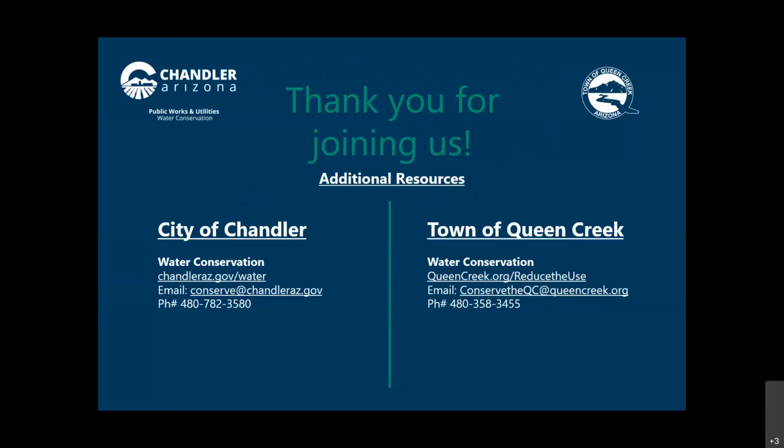Okay. The first one is, any recommendations on moving emitters when the canopy is over the sidewalk and driveway? At that point, you are going to have to push through to the other side of the sidewalk, or if you already have a line over there, just start popping in emitters on that side. Now, sometimes you don't have the option to water all the way around the canopy. You know, it's over the back wall and into your neighbor's yard. Just hopefully they're doing some watering in their backyard and they're actually watering that side of the tree for you.